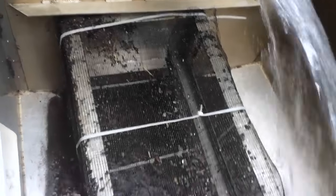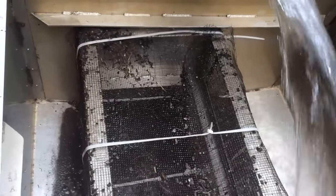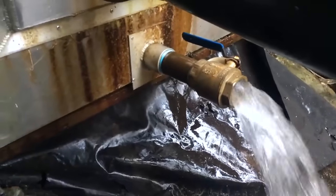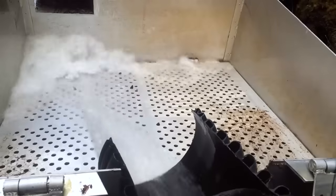One thing to point out is that the bottom of this intake box is at an angle — like a V shape. You can see the corners down at the bottom; it channels the sediment that gets through the primary filter down into the very bottom, which is below the fine filter. It channels out through this valve here, so any of that sediment naturally settles to the bottom and flows out. Even with the intake fully submerged at the other end of the culvert, you still have that same small amount of water coming out that I was using to clean it.